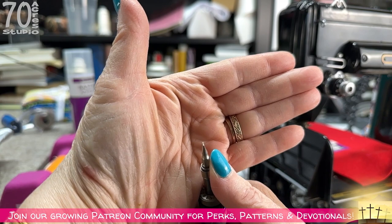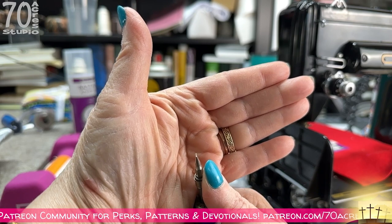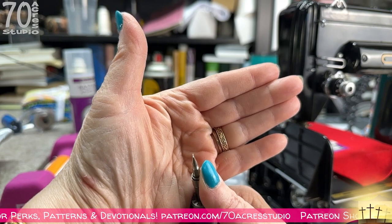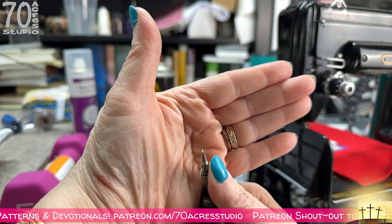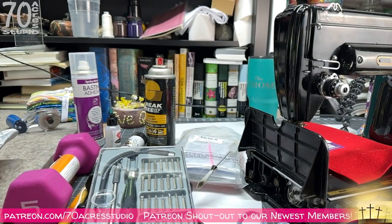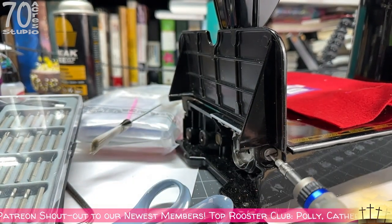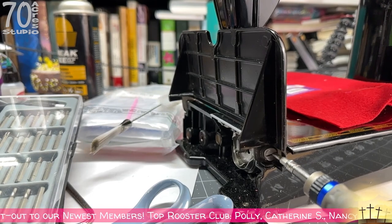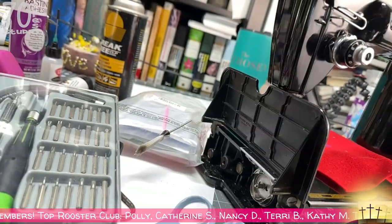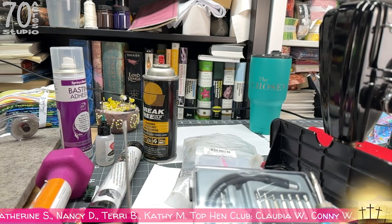You don't want wiggle room, because when you have wiggle room and you try and apply force, you end up stripping your screw. And some of the screws on these old machines are one-offs. In other words, that screw was designed just for that part, so it may not work. So you don't want to use a tiny screwdriver like this in this big screw, because it's really wiggly and you'll end up stripping it, and that is not good. So I have a variety of bits on this set that I'm using. And I have another screwdriver that I know works.